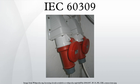Color identification: The color of an IEC 60309 plug or socket indicates its voltage and frequency rating. The most widespread colors are yellow, blue, and red. The black version can often be found on ships. All AC systems are either 50 or 60 Hz unless otherwise stated. All three-phase plugs and sockets are available in 3P+E or 3P+N+E configurations.